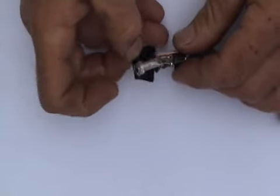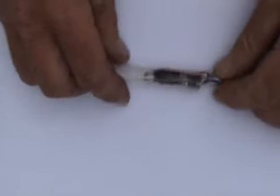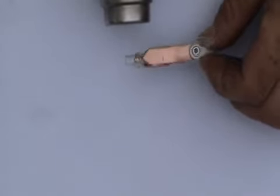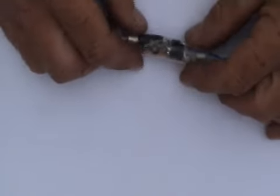Right, now wrap some tape around the top of the butt splice connection to stop it shorting out against the copper later. Okay, that keeps it all nice and insulated. Then feed the whole assembly inside your bit of heat shrink tubing, all the way, so it sits in the middle there. Then seal this end up with some heat, and that helps melt the hot glue at the same time. Okay, let that cool down a little bit.